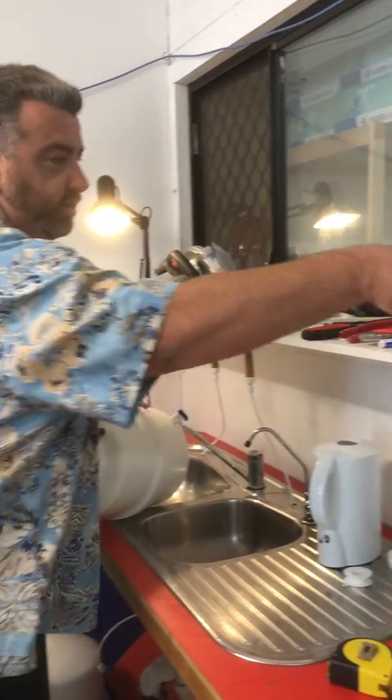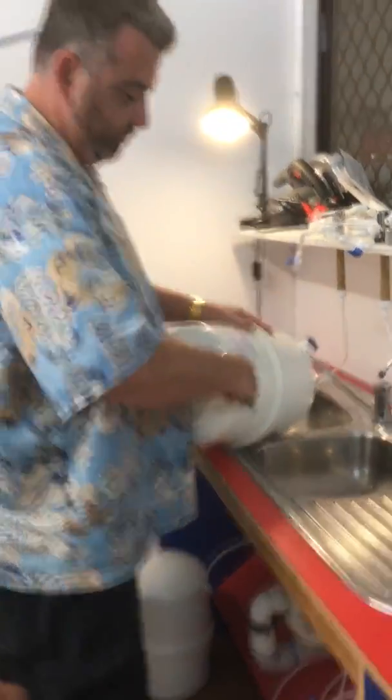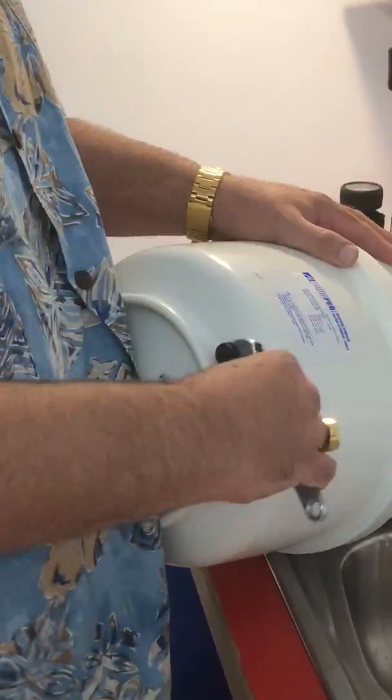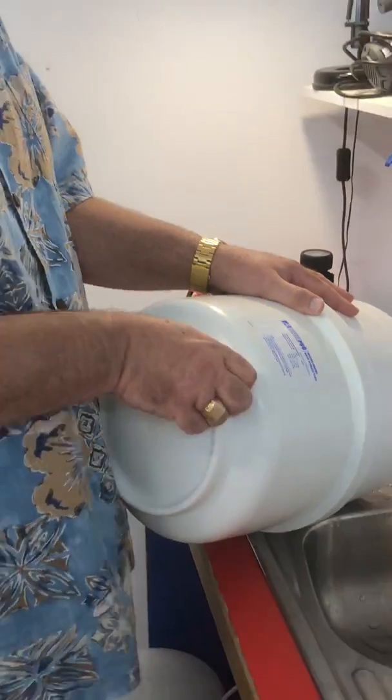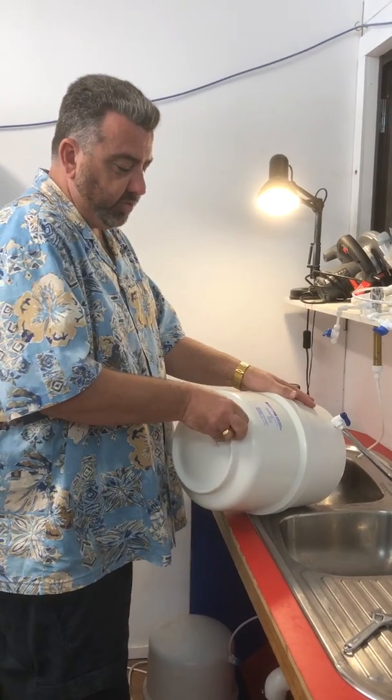All you've got to do is remove on the bottom of the tank the little plug — underneath that there's a little valve. You must leave the tank tap open to do this, otherwise you can pop the bladder.